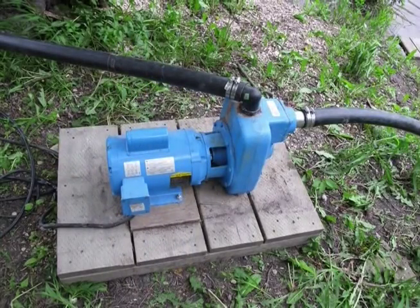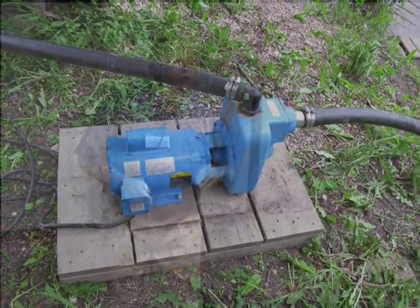You're better off having a source of electricity online versus trying to use gasoline to generate your electricity, but this is an option. One thing about this pump: it runs at a certain RPM. When it's on, it's on. You could put a rheostat on it, but if you don't know what you're doing, you can burn it up. Check with your well guy — it runs one RPM, designed to pump so much water at so much pressure.